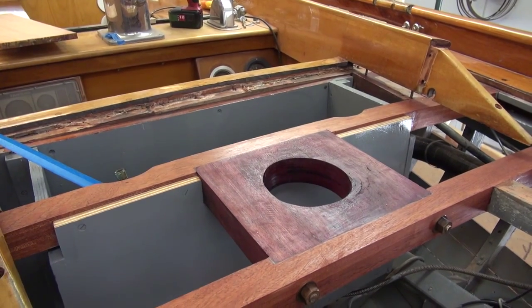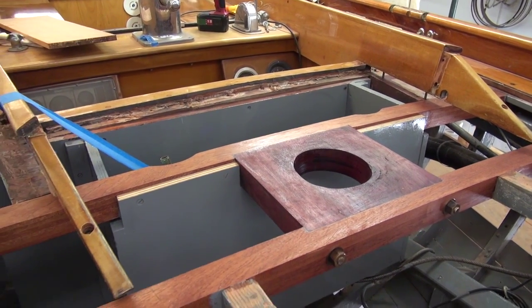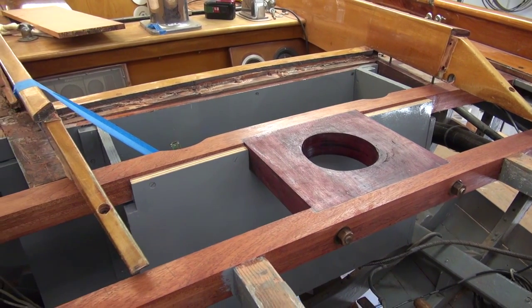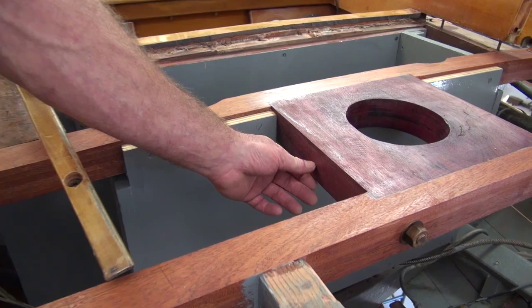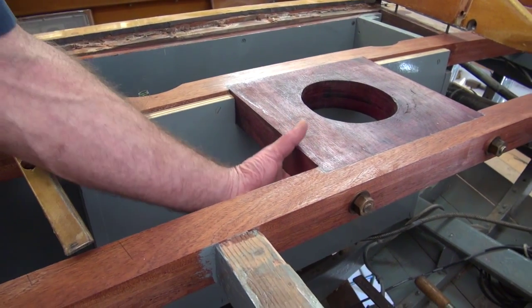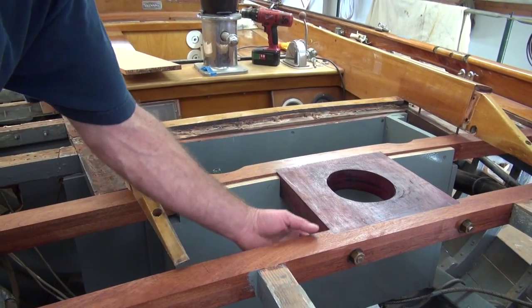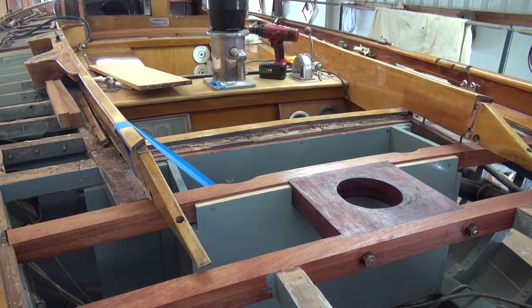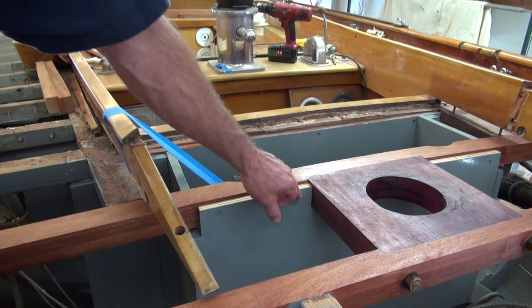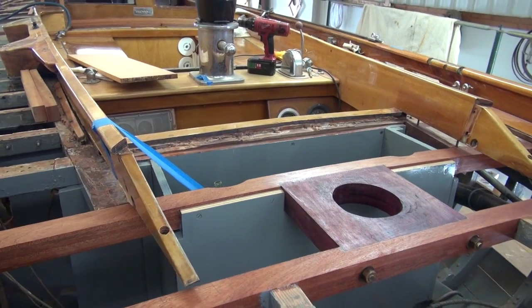We got that piece of Purple Heart out of a knot hole right here, so the way the grain goes around the knot is very strong right there. A little overkill, but we had the piece of wood. It was only about half the thickness, so we went ahead and made it full thickness of the beam. This notch goes from about five-eighths down to zero, so that is all very, very solid now. The bolt kit itself is notched tightly around the block too, for more strength.